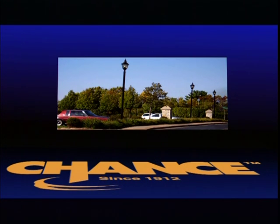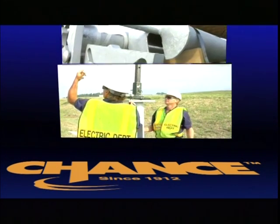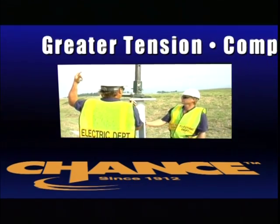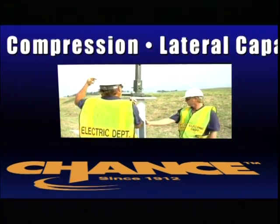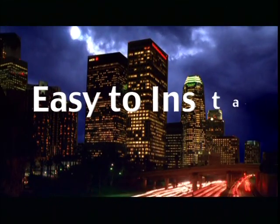Chance foundations install in minutes while providing superior strength and durability to poles up to 50 feet tall. The secret lies in the one-piece design. All Chance steel foundations feature a true 3-inch pitch helix that cuts and displaces soil as it screws into the ground, thus ensuring greater tension, compression, and lateral capacity. And Chance foundations are easy to install.